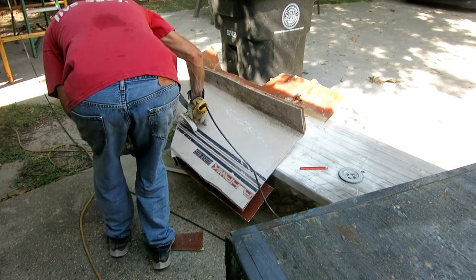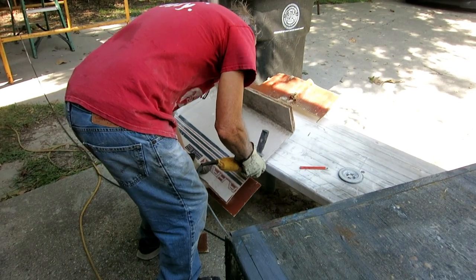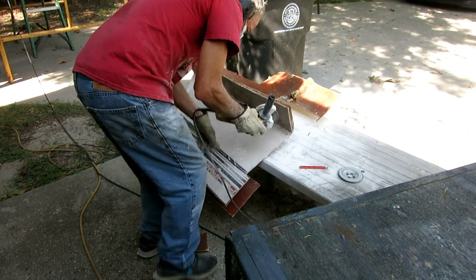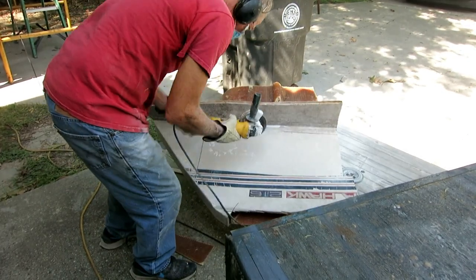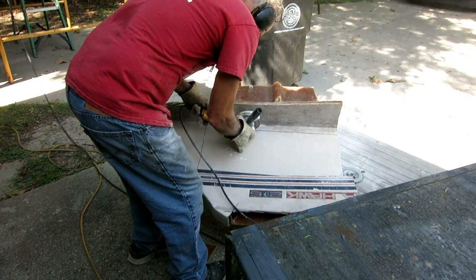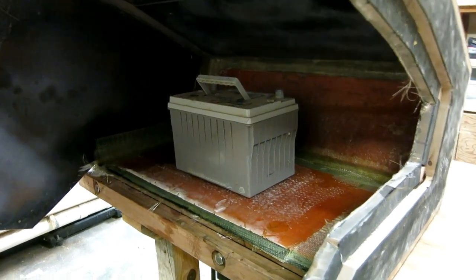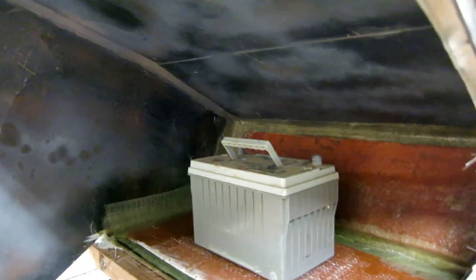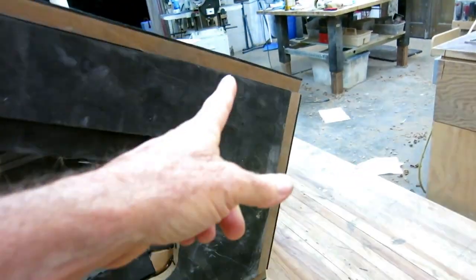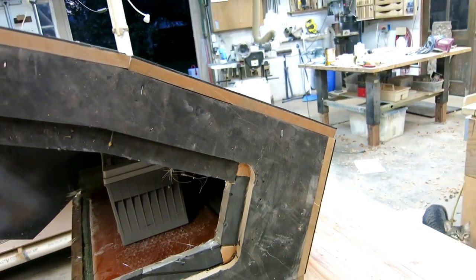Other than the dust, the noise, and the itchiness, it's no big deal. I am working right in front of a big box fan - that green object you see in the foreground - which blows all the dust away. Once it's cut out, I'll taper the edges and scarify the surface that's going to be bonded. I've got the top part glassed and the face glassed, and this side is the doorway - it's glassed. This morning I want to glass the back and this side just up at the top part. I can't really tell how thick my corners are until I open it up and take a look.